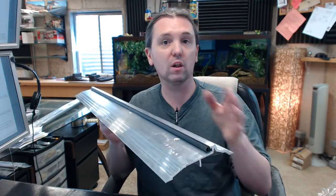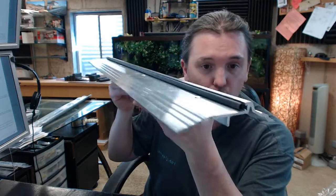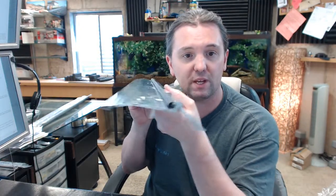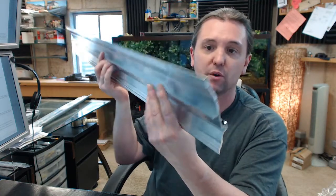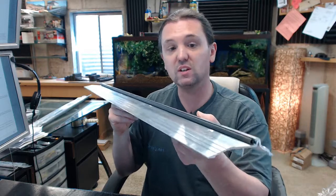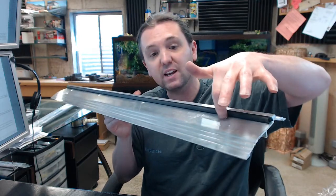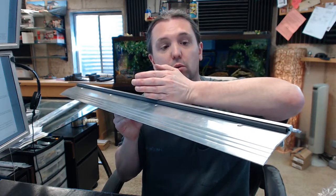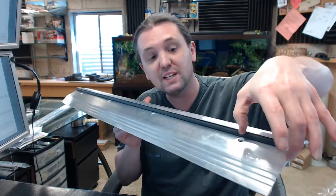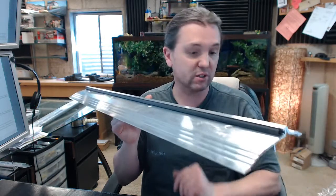Also available in all of the common lengths. If you have need for a custom length, by all means let us know by ordering the next longest piece or pieces and indicate in the comment field what length you'd like for us to cut the material back to. The reasoning is if you had to cut this 48-inch piece down to, say, 42-inch, you'd eliminate that countersink that's there, and the next one's all the way over here. So if you order a custom length, we'll not only at least give you that countersink at the proper distance from the edge, but the proper center to center as well.